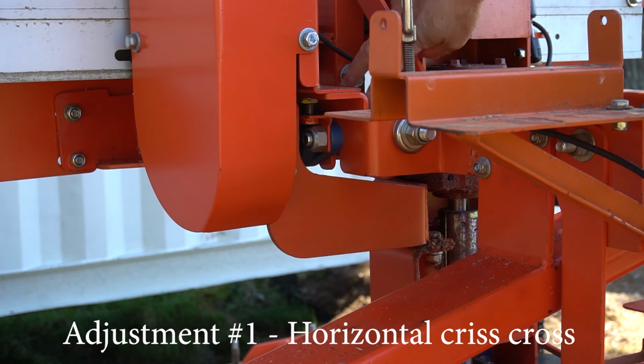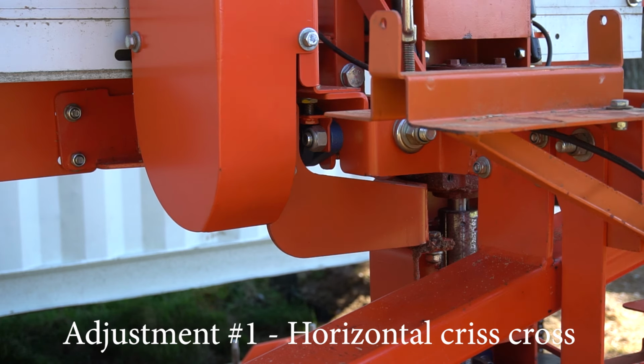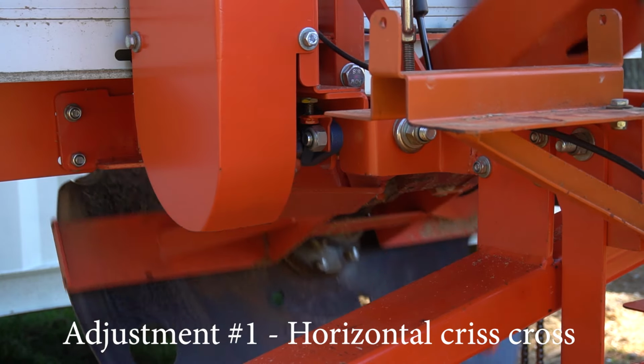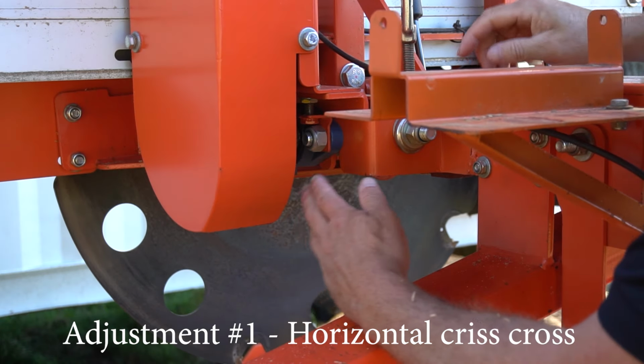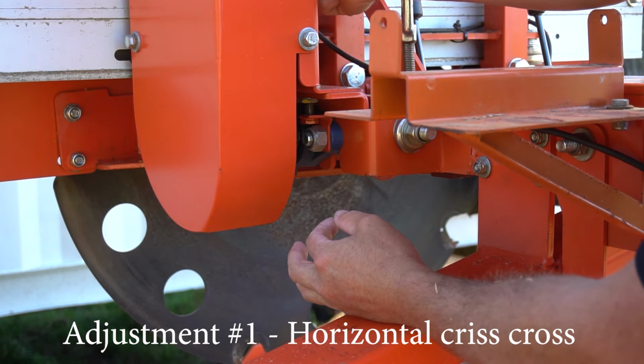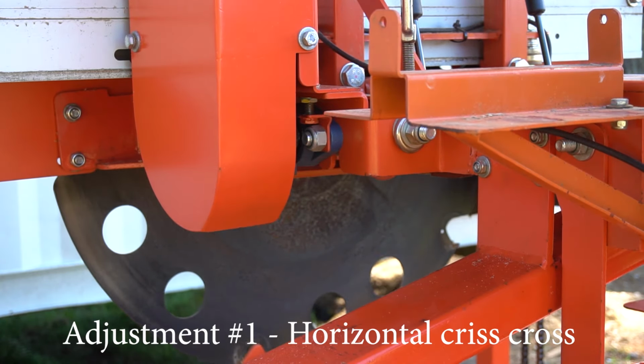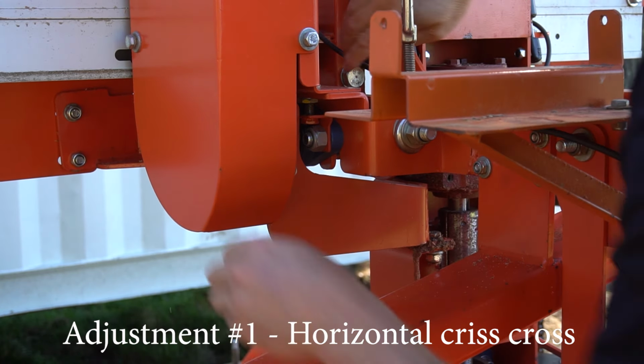Right, so you've got two big bolts here. They look like 5/8. They're M16. So you need to crack them open with two ring spanners. To crack them open, you'll have to swing between horizontal and vertical to get your ring spanner in here. So what I do is I use the open ring spanner at this side, and I use the closed ring spanner end on that inside. Right, so just crack them open, and then crack the far one open there.